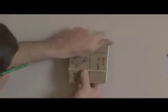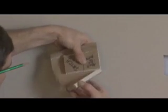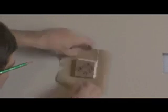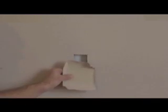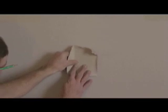After cutting the back of the paper, slowly split off the excess pieces, leaving the paper on the front of the drywall patch, and clean it up. Check the drywall patch for size, making sure that it fits loosely in the hole.